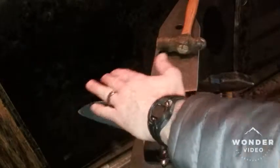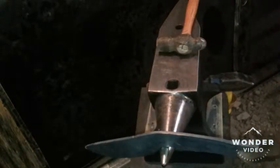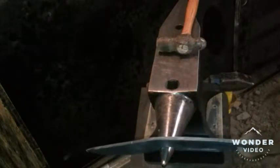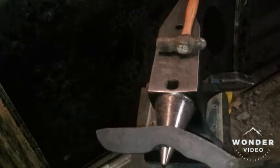I'm going to put my hand in there — it's still quite hot, but it's nowhere near forging temperature. You would never want to strike a blade when it's this color; you're pretty much guaranteed to crack it or break it. Just let it cool down a little bit here, and then I'm going to pop it back in the forge — to be continued.